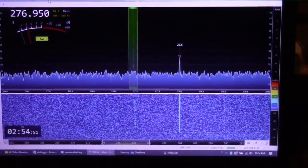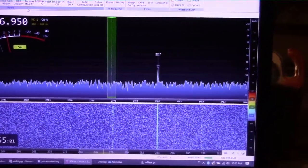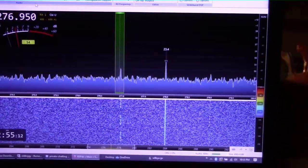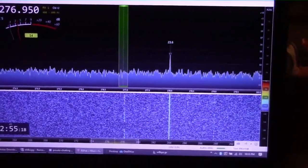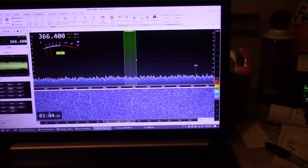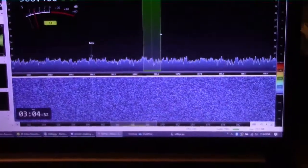There were tons and tons of other non-directional beacons that we could have stopped at, and of course there's plenty of military signals much lower in frequency, but there's no point in showing that the passive antenna can hear them and the little active antenna cannot. We've already established that. Now let's keep going higher in frequency. Alright, so here we go. This is a station from Maniwaki, Quebec. It's another non-directional beacon at about 366 kilohertz,